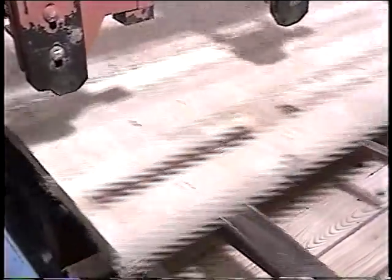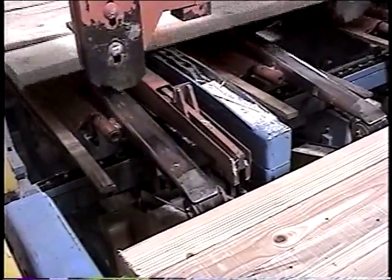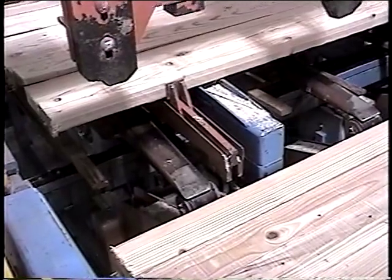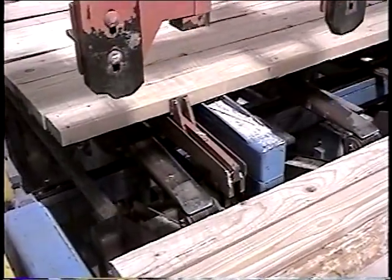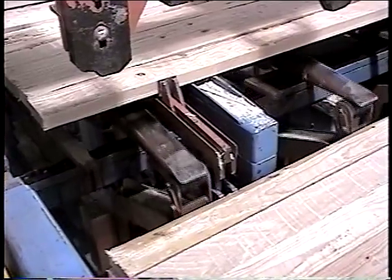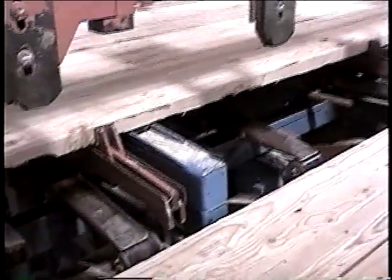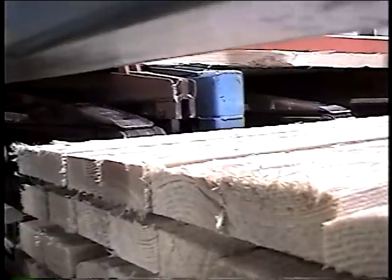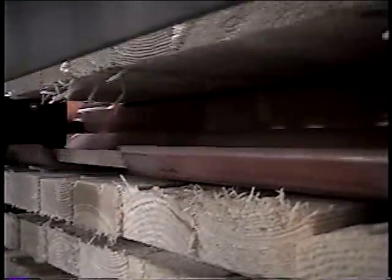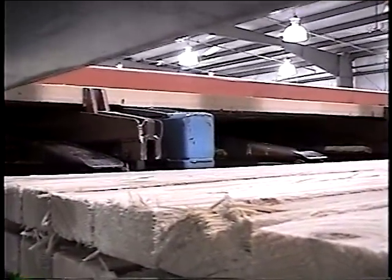From this lumber line side view, as the stacker cycles, you can see the front stops dropping to allow the lumber to move ahead on the forks. As the forks return home, you will observe both the zero and the two-foot sticker being picked up. As each sticker enters the pan, the smooth pickup is evident. The pickup of the sticker by the holding pan is extremely reliable. This kind of transfer reliability greatly improves the overall efficiency of the stacker. The lost time associated with clearing sticker jams in other manufacturers' equipment is just not there with the Gillingham Best VPG system.